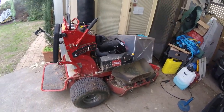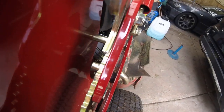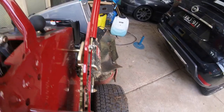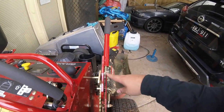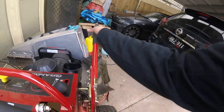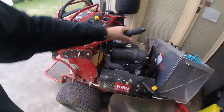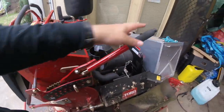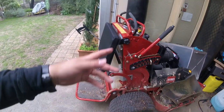I've modified the Grandstand a little bit, because the geniuses who designed these things put a little tab on the bottom bit. When you tried to pull the deck up without holding that button down on top, it would catch and you wouldn't be able to pull the deck up. In a situation like block slashing or mowing new lawns, if you hit something, your instinctive reaction is to just pull it up — you're not thinking about pushing the button. If you pulled it hard enough, you'd hurt your arm and shoulder because it blocks on these teeth. I found that really annoying, so I cut it off. Haven't noticed any problems. Now I can just pull it up without having to push that stupid button.